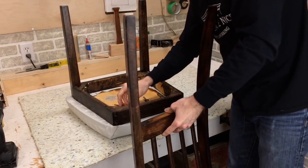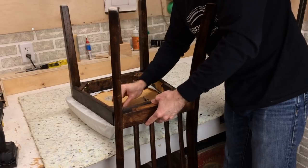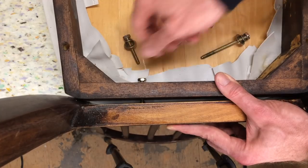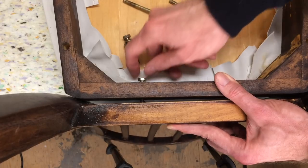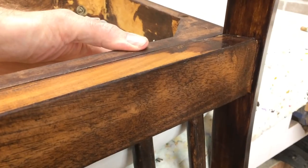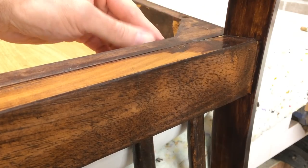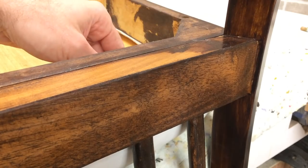Here's the final stretch. I'll put the bolts through. There are three bolts that are shorter that hold on the back here, and then there are four bolts that go into each leg. What I've noticed is there's a fair bit of play in the back here. So to get those holes in the right spot into this leg, what I'm going to do is stand it up, tighten up everything so I get the chair level and there's no rocking, and then I'll install those insert nuts.